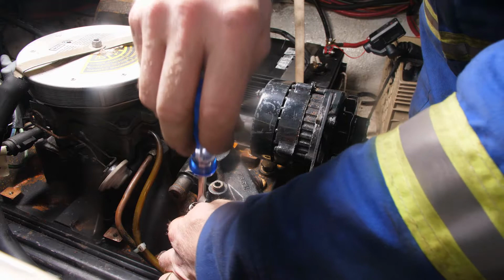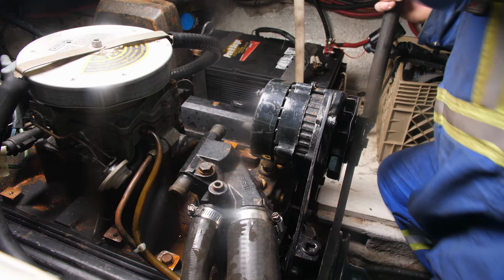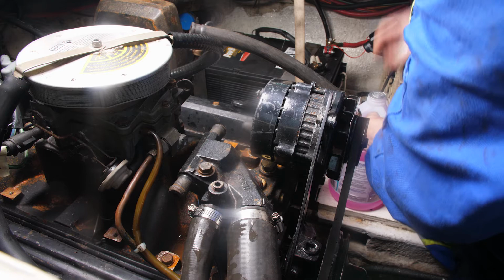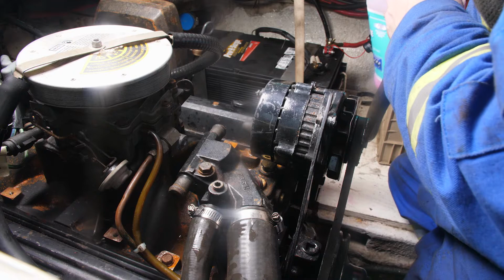And now we're going to continue putting some antifreeze into these, the OMC exhaust manifolds. So these will only fill up to a certain amount until they start flowing out the back end of the boat. So it's a good idea to have somebody with you when you go to do this part, and you can have them standing behind the boat and they can tell you when they're starting to see glycol coming out the back end through the drain. That way you don't waste any and end up spilling a whole bunch of glycol on the ground. And I dare say that's enough.